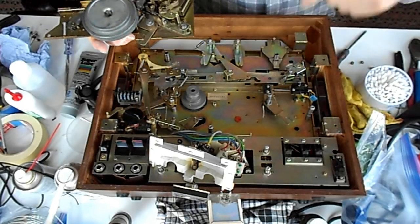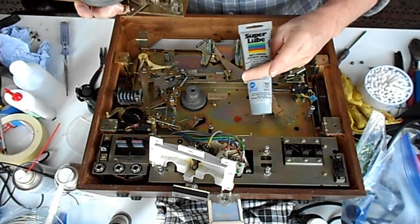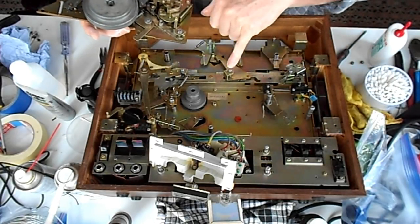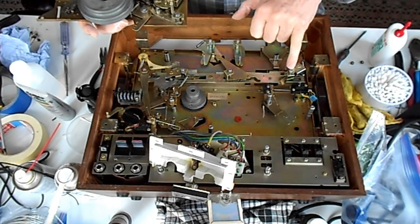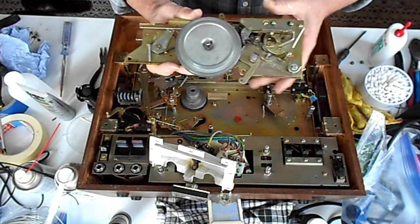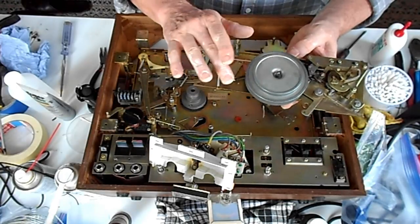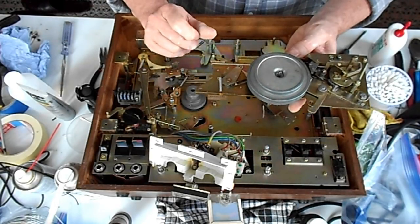I've taken everything apart that needed to be taken apart with this new grease, this stuff Super Lube that I purchased. I've gone ahead and greased everything that was greased before. I'm using Singer sewing machine oil where it pivots. It's grease underneath, it pivots there. I put some sewing machine oil on the top of these. This one as well, grease underneath, a little bit of oil where necessary. The other thing is I cleaned all this and oiled it, whereas before when you pushed it, it wouldn't spin. You can see now that it spins for a long time. So this is all in good shape. I've also greased everything here, everything that moves, so it's all like new again.